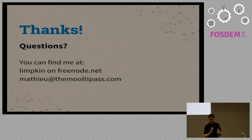It will look at the flash and compute a given hash on this complete file. If the hash is correct, then it is going to update the firmware itself. So it is a two-pass process. The first pass is going to check the checksum. Then it is going to do a second pass. Basically, it's going to see each block, flash it to the firmware, but still set a given boolean that will prevent the device from booting. So we are deliberately bricking the device until it is completely flashed and the hash has been checked again. So. Yep. Thank you very much.